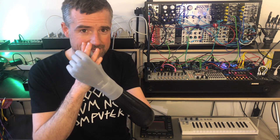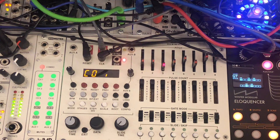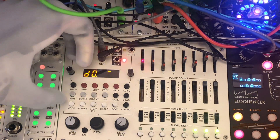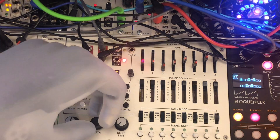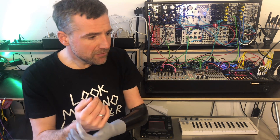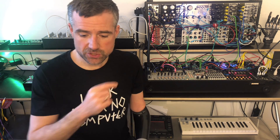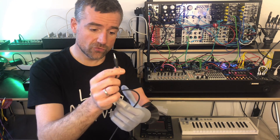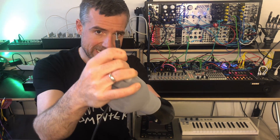As useful as this hand is, it's really difficult to control the synthesizer with it — all the tiny knobs that you need to tweak, and you need to tweak them fast and with precision. It's really difficult to do that with a prosthesis like this. I've always wondered: with a modular synthesizer, any knob on the thing can basically be remote controlled with a voltage. There is a jack next to each knob that will accept a voltage in the range of 0 to 10 volts — a jack that looks like this. So basically you can control any knob on the synthesizer with a jack like this.